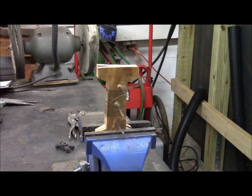The knife scales have been temporarily pinned and taped together, and I've used ordinary nails as pins. These are purposefully smaller in diameter than the brass pins I'll actually use on the finished knife. So we're going to trim those and then reshape the grip so that we get it more nearly uniform before we actually mount it on the metal.